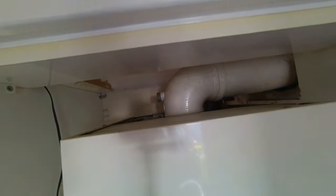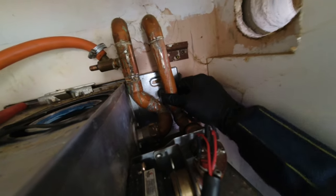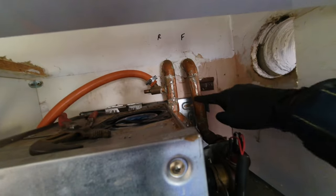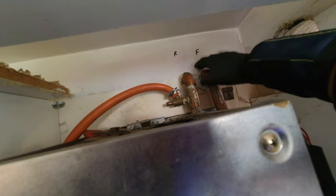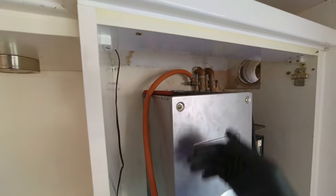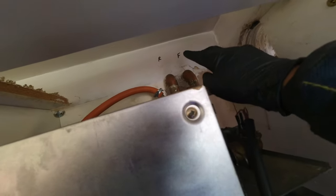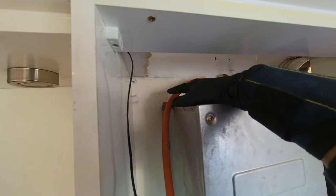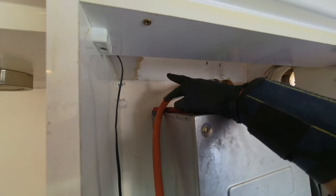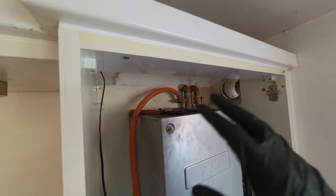It's not going to be as straightforward as we'd have liked. Just taking the pressure off the system — normal water coming out. Managed to undo the two 28mm connections but we've got a little bit of play on the return and nothing on the flow, so we're going to have to get the multi-tool and cut the pipes to get the boiler off the wall. Then we'll need to go into the wall and see what's going on, because we need to bring flow and return to the other side. The flow is on the left and return on the right — they're flipped as well, so that's another little obstacle.